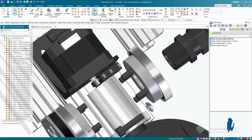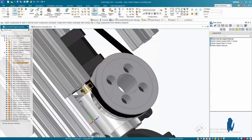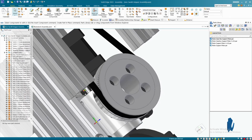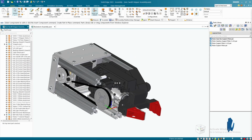and it homes by a limit switch that is looking at this difference in outer diameter by this clip that clips onto the actual motor shaft, and the software will only read a falling edge from this sensor, so it's always from the same spot. And all of the internal wiring will route through this hole here. So now that I have a general plan of what the robots need to do the job, let's put together the cell.